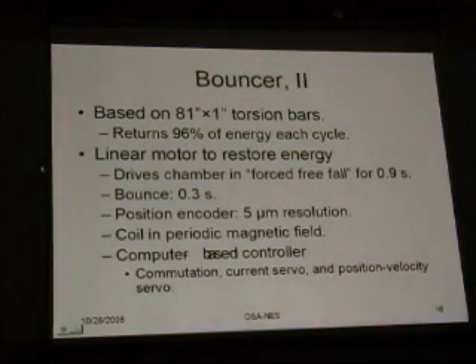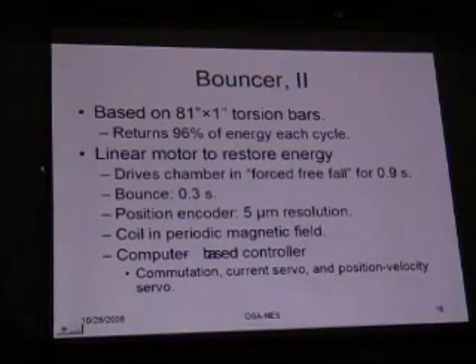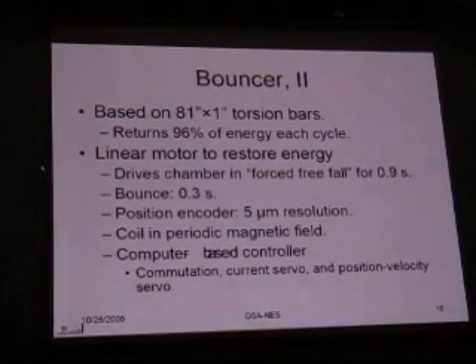If you're measuring velocity to a quarter nanometer per second over a run, then you want to start the test masses off not moving very fast. When you have ball bearings rolling on rails, you have about a micron noise at 100 hertz — you're at millimeters per second in terms of RMS noise. So what you need is a very quiet system which doesn't have ball bearings and doesn't have a lot of motor noise. We started with mock-ups using ball bearings and a noisy motor, and we're working the bugs out.